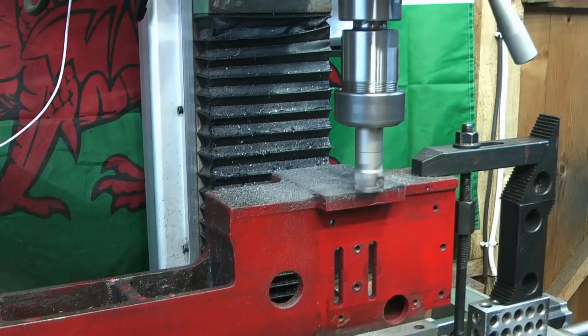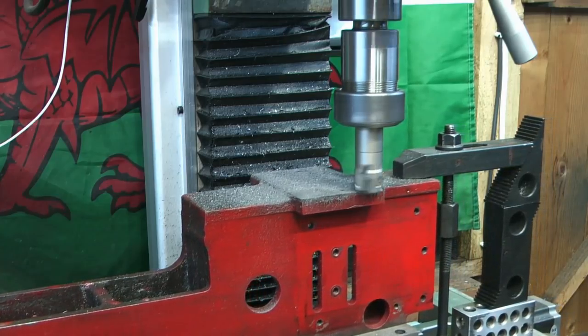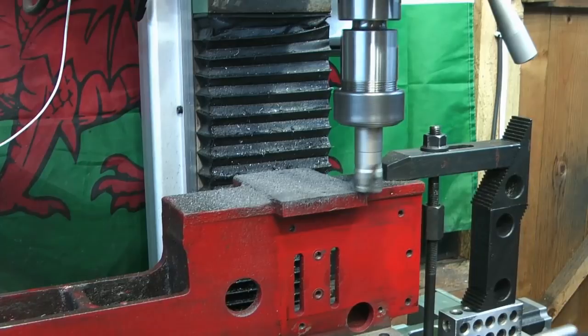This should be just about the last cut. I've gone to exactly the same depth with the quill, everything locked. When I break this down and clean it all up, I'll take the sharp edges off the corners. I'm hoping when I've cleaned the table down it sits nice and flat and doesn't rock - because if I'm clamping this to something flat and the bottom is out of plane relative to the top, I'm going to be clamping it out of shape. Hence why this little exercise.